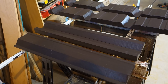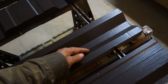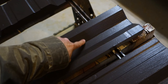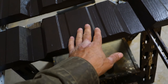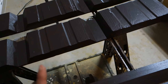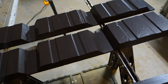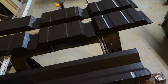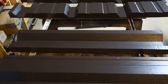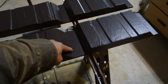Usually I like to get it into place and just drill the pilot holes while it's in place. But I ran into problems with the first exhaust frame — I lost track of where the major ridges were falling — and several times I ended up drilling along this slope. Drilling along the minor ridge slope is no big deal, but when you drill in the major ridge slope, your drill bit will hit that metal siding sandwiched between your wood frames and it will try to ride down that slope. If you're pushing hard enough, you will break your bit. I broke two bits trying to put in that first exhaust frame. So to preclude from doing that again, I'm going to drill my pilot holes now close to the edge but without drilling into the actual slope itself.